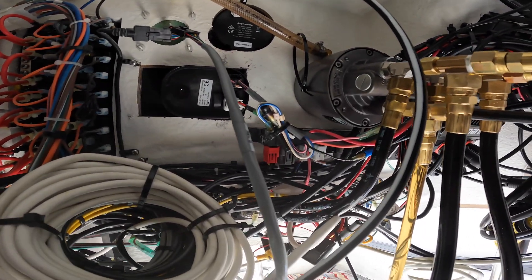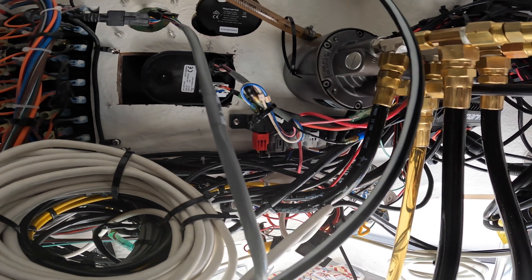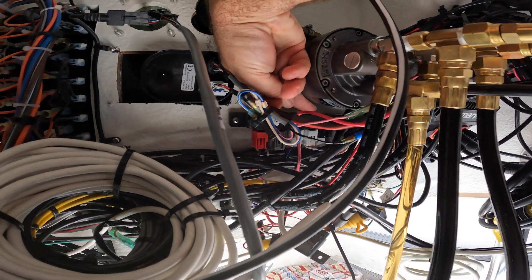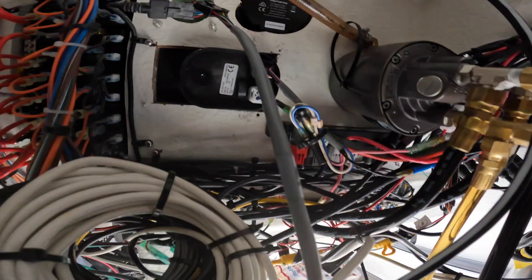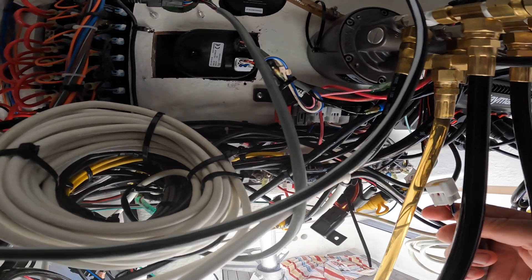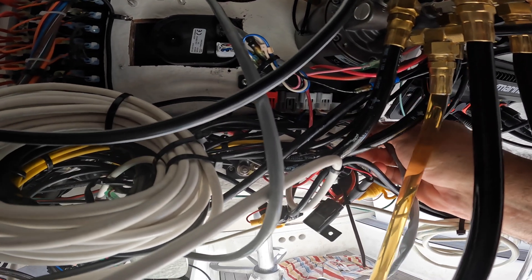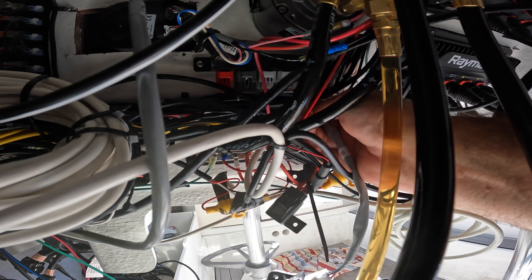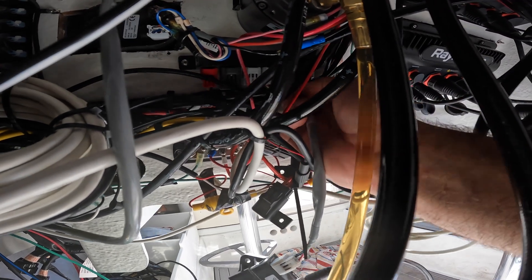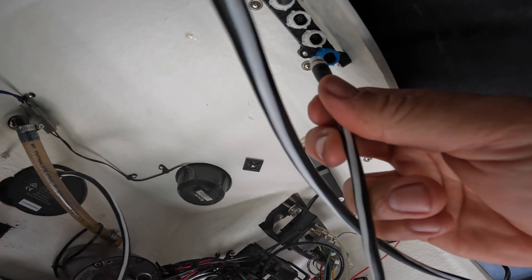This is going to be a bit tricky to film and I haven't buttoned everything up yet so there's stuff everywhere. What you want to do is connect the 6YG to the open device port. You can see on the Command Link Plus there are several ports already plugged — I have one open that is a device plug. So you take this and set it in there. Then my SeaTalkNG DeviceNet is already hooked up, and I'm going to run this over to my network.